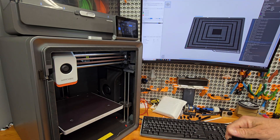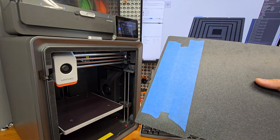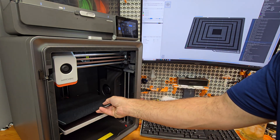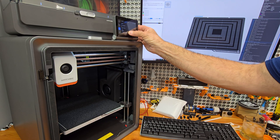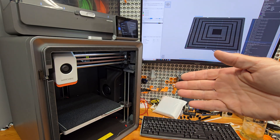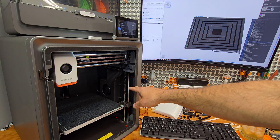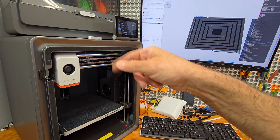So this is what we're going to do. We are going to use some painter's tape on the back of our sheet here to make one side higher - three layers of tape - so this side of the plate is higher than the rest. We're going to pop this in and calibrate a bed mesh with auto leveling. We're going to print a spiral, five millimeters wide, one millimeter high across the whole bed plate, and watch close up to see if the Z is moving as we get to the side which is higher than the other.